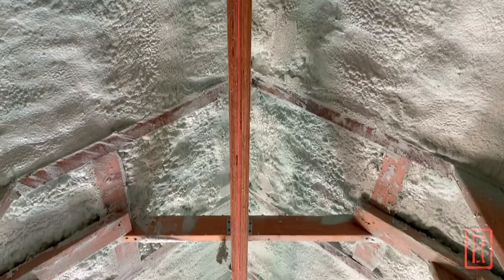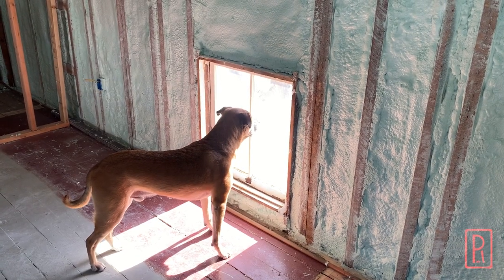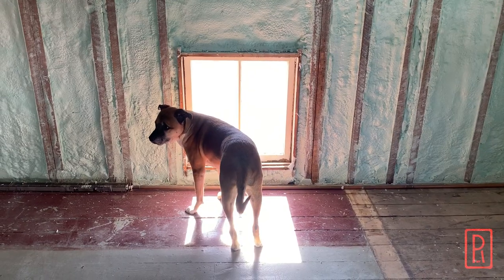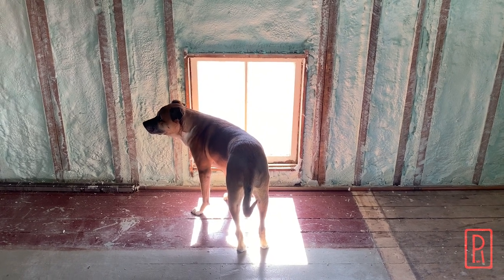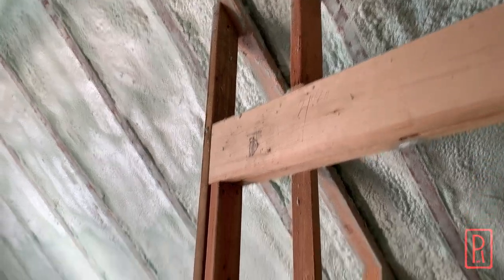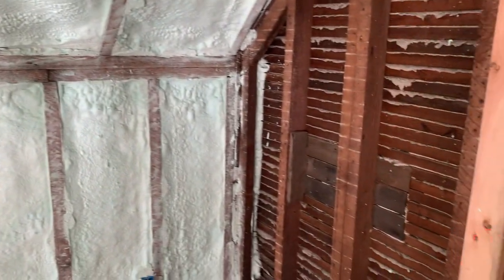This beam then allows me to figure out my measurements to place the barrel vault in the room. The next hurdle to alignment is that the floor is not level or flat — it slopes downwards towards the gable end and has about a one inch dip in the middle of the room. This makes all my height measurements very difficult and inaccurate. So let's look at this on the computer.